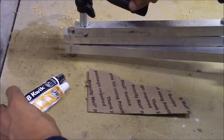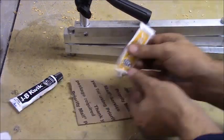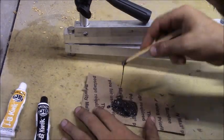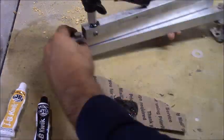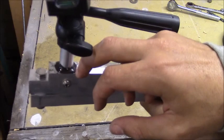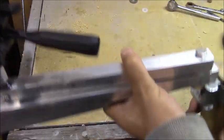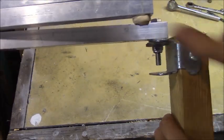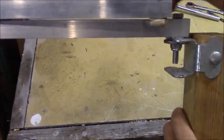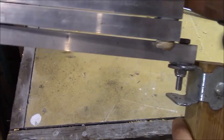The last thing I did was put a bead of JB Quick Weld around the tripod head joint to really solidify it. The JB Weld cured overnight — it's really hard now with no movement in the head anymore. I also noticed the nut stuck down lower and would hit against the arm making a tinking noise, so I just wrapped a rubber band around it — it doesn't make much noise if I do accidentally hit it.